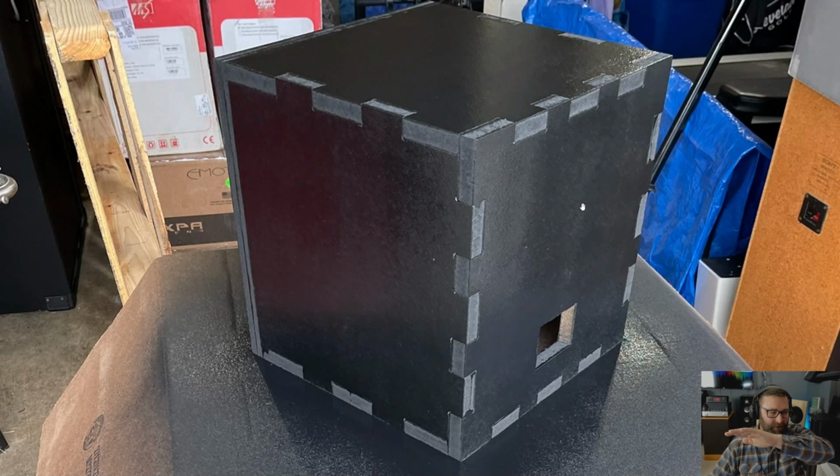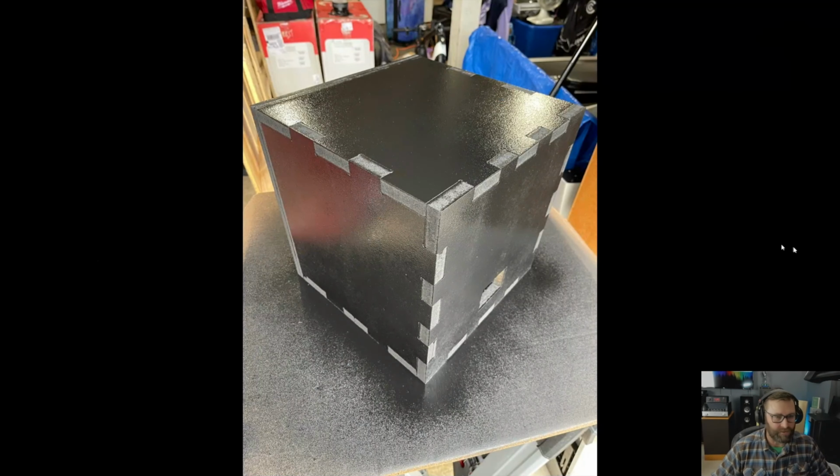So as you're spraying your spray paint, go left to right, left, right, and kind of sweep the sides with the paint, and then you're going to leave for a while, and when you come back and do the other coat, go up and down and kind of sweep, so you're changing the pattern. It makes for a lot better finish when we're done.